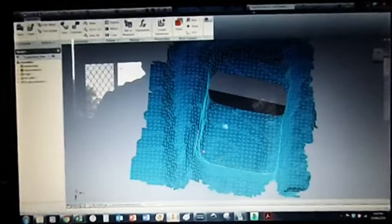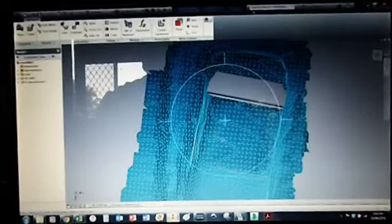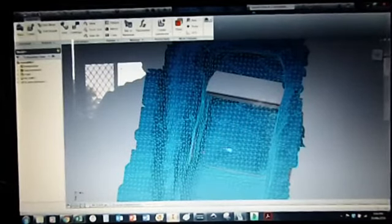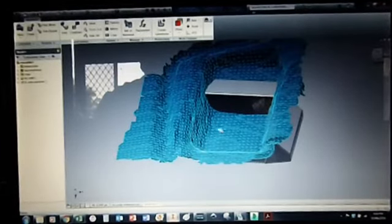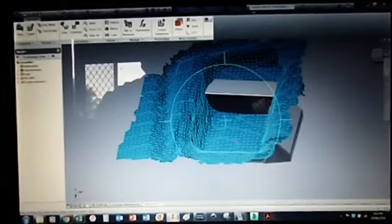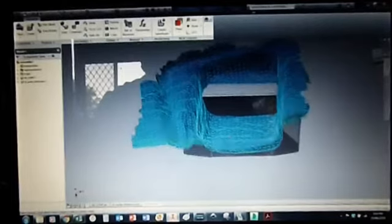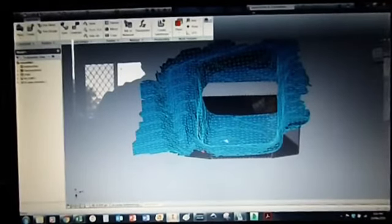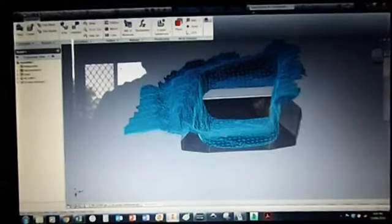I've got to try and work out where the pickup actually is, and then I can try and do a gated trapdoor setup for it, and then just do like a tab and slot design so I can laser cut four holes in the bottom plate and just have this four sides, male tabs on one side and female slots on the other, and male tabs on the bottom. They just all sort of clip together, then put the little hinges on for the trap door, and it just all sits in, no measuring then. And you can just weld it all up.